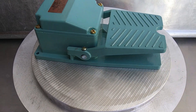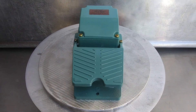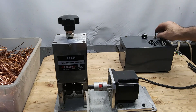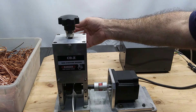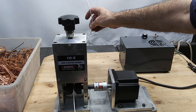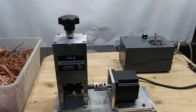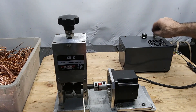Adding a foot pedal. In the recycling business, used wires are bent and stripping them of insulation requires preliminary manual straightening. Even after extensive effort they are imperfect, which causes the wire to shift from side to side while being fed into the machine. The operator has to direct the wire with one hand while the other hand is busy controlling speed and forward/reverse direction, so activation of motion via foot pedal becomes very helpful. Our controller allows operation with or without a foot pedal — just plug in the connector and the machine automatically switches to the appropriate mode.